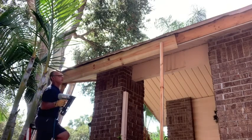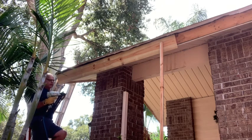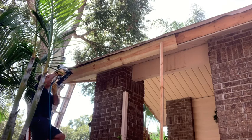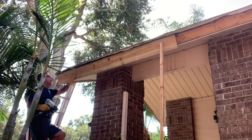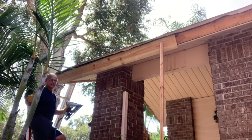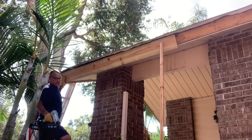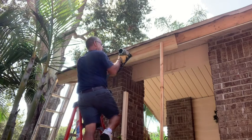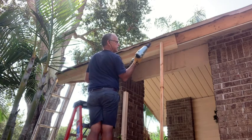Now when you shoot a nail, especially these light nails, don't just shoot it straight in. A nail has more holding power if you angle it - angle up like that, then angle down like this. If weather or storm winds are blowing, it's going to take more force to pull those angled nails against themselves to pull the board out. If they're straight in, the board can come off a lot easier. One up, one down, one up, one down - never straight in unless you can help it.